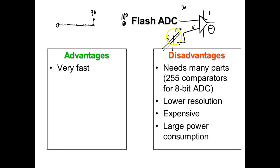So if the output switch is negative, I know that my ramp is what? Too big, right? Then I would drop down to what? Till I drop back to 2.5. Then this guy right here would switch positive. So now I know I'm a little what? I'm a little below it. And then we'd go half again. So within, I think it was 5 steps, you would be in.